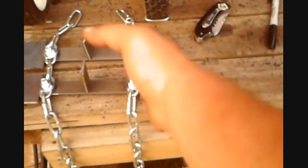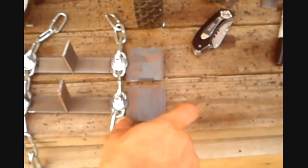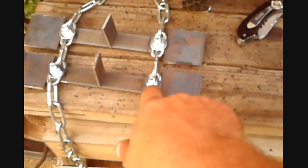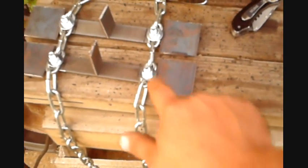This part of the track here is where the tire is going to be riding on. It's going to ride on the outside of the track. The next spot is about an inch in. This part is going to be two inches wide, and then an inch inward is going to be where the chain is going to connect to the track plate by bolts. There are two bolts per track plate, five-sixteenths by eighteen thread, half-inch bolt standard. Then one inch in is going to be where the track attaches, and then the rest of it is going to be for the track guides to keep the track centered.